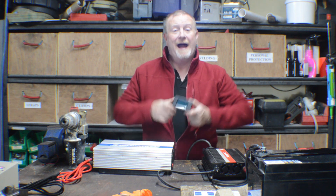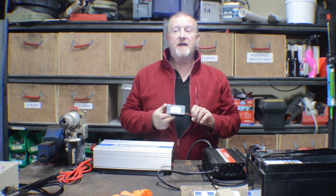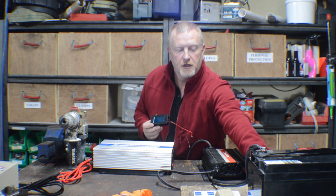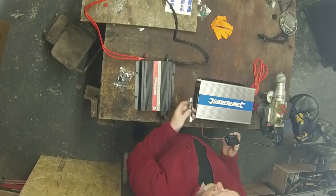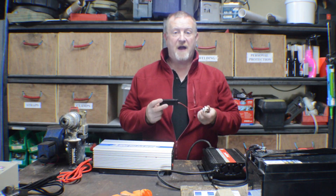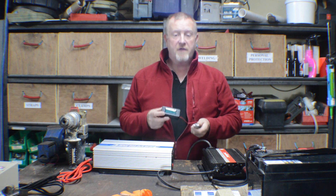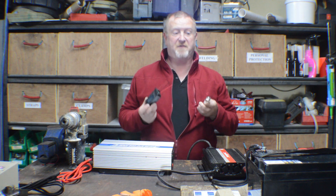When we're in the camper van we have this device — our battery monitor. I'm going to show a bench connection of all of this and how they work for real in the camper van, but just for this video: this is connected to our shunt, which goes in between the battery power and the inverter. It records how much power we have in the battery, how much remains, and how much power we're using on any given appliance.